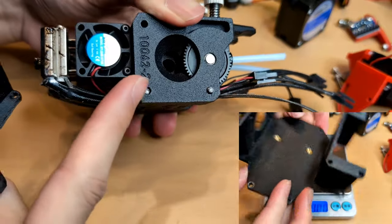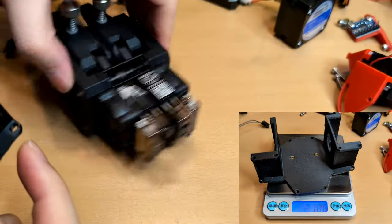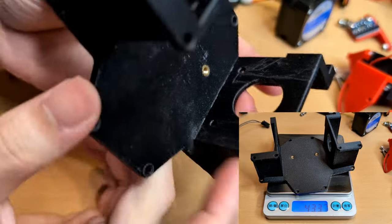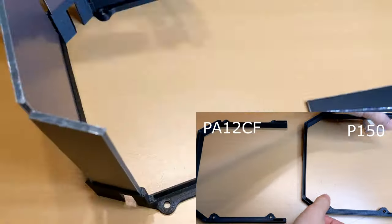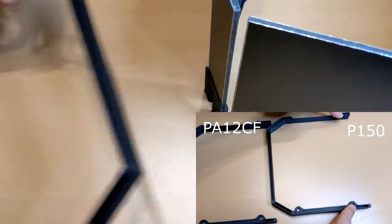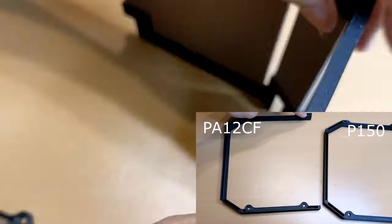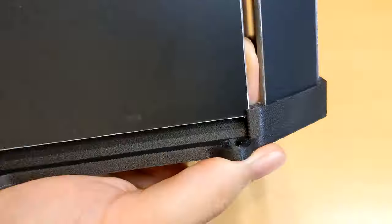This material is an excellent option for creating sturdy and lightweight parts. It can endure temperatures of up to 120 degrees Celsius. I have used this material for low-creep deflection applications, such as the coupling cover in the threader project, as it provides lightness and strength. It is also an ideal choice for extruder frames in future projects.